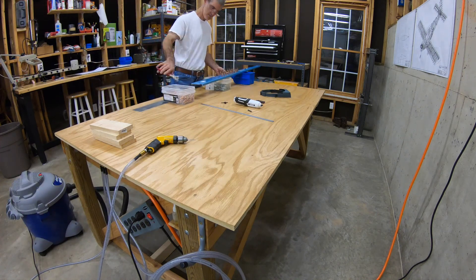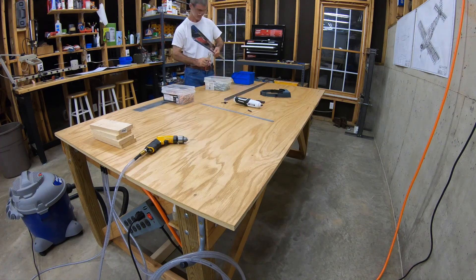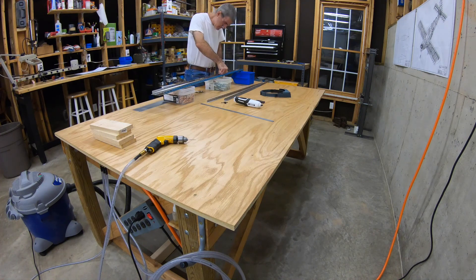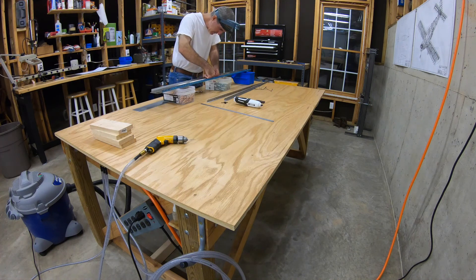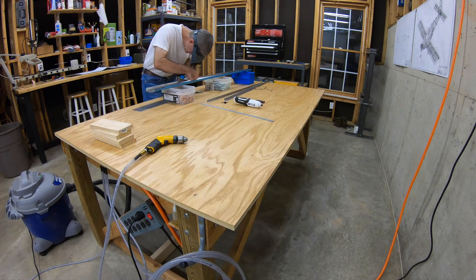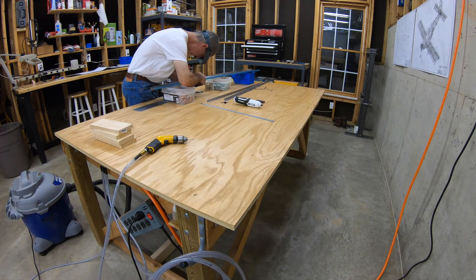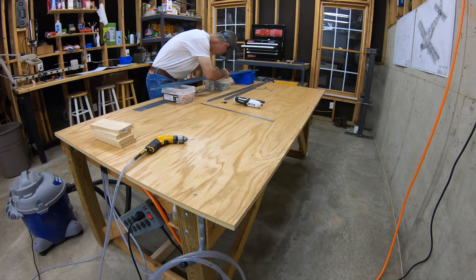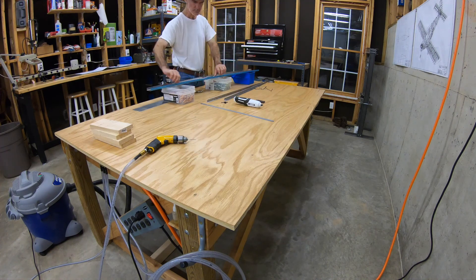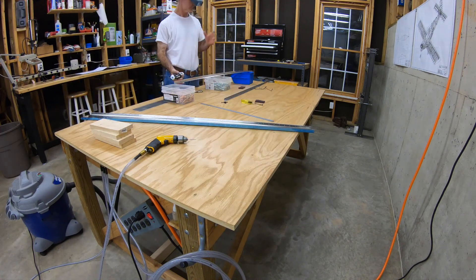Probably seems like I am fanatical about using the vacuum cleaner all the time. Those holes where you're match drilling and creating a new hole in the spar cap — not just enlarging an existing hole — that actually creates a pretty good bit of aluminum chips and little curly cues, and after a while those make the table pretty gritty. So I don't want to scratch things up needlessly, that's why I tend to clean up as I go.